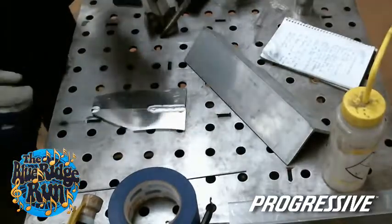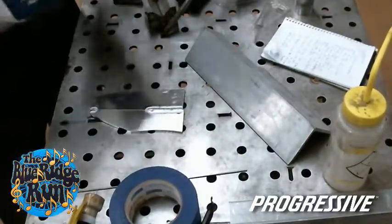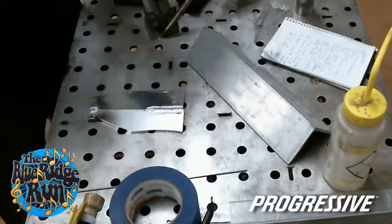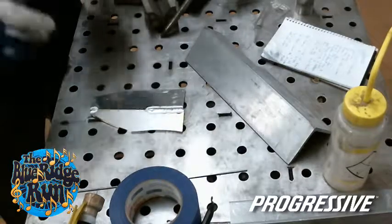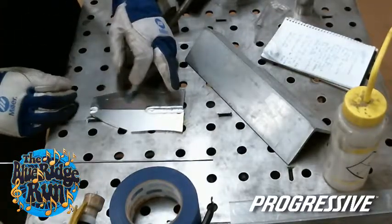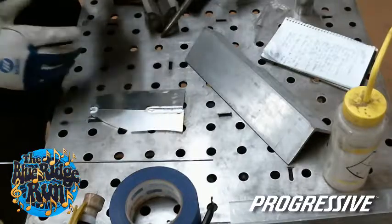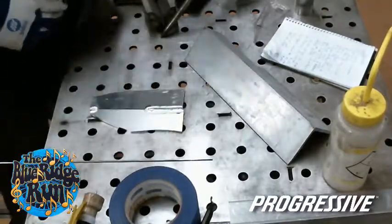You're speechless. And you know, with aluminum, and he kind of touched on it, of how your movement is, when you're running with stainless and you're filling as you go, I almost go back over, almost like a lattice type, to catch my previous weld. Not only because of how the aluminum rod flows, but if you've ever chased a hole in aluminum and trying to fill things or trying to find a leak or anything, that's just one extra way to throw a little more material on top of itself